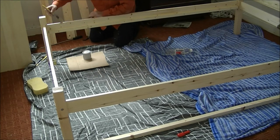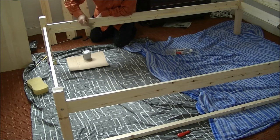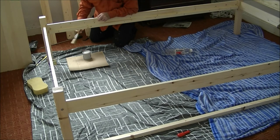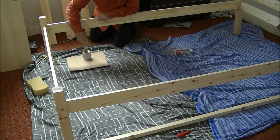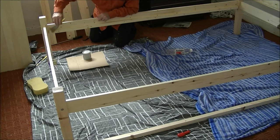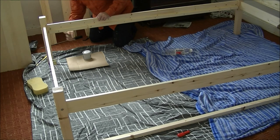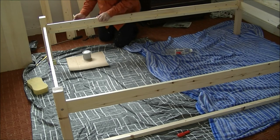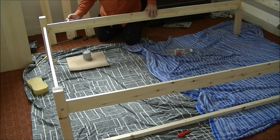And I can now paint the inside. I'll do the same underneath, because I'm going to do the whole thing now. And let's do it along the top. Now, always make sure you unload the brush so you can lift off any surface that may have run in the corners or around the edges. I've done it along to here, and now I'm going to do the outside as I move backwards, so at no point am I going to be touching or sticking to any wet varnish.